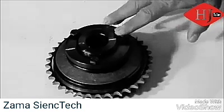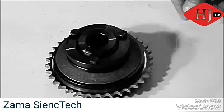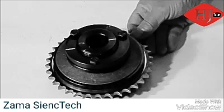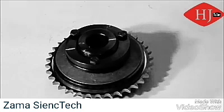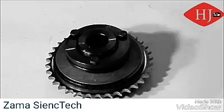The TL500 and TL700 torque limiters are built exactly the same. The only difference is the 500 is the lighter duty and the 700 is the more heavy duty. The reference material mentioned earlier will show you the ranges of torque settings for each torque limiter, but the procedure for putting them together, the components, and the procedure for setting the torque are identical — it's just different numbers from the reference table.